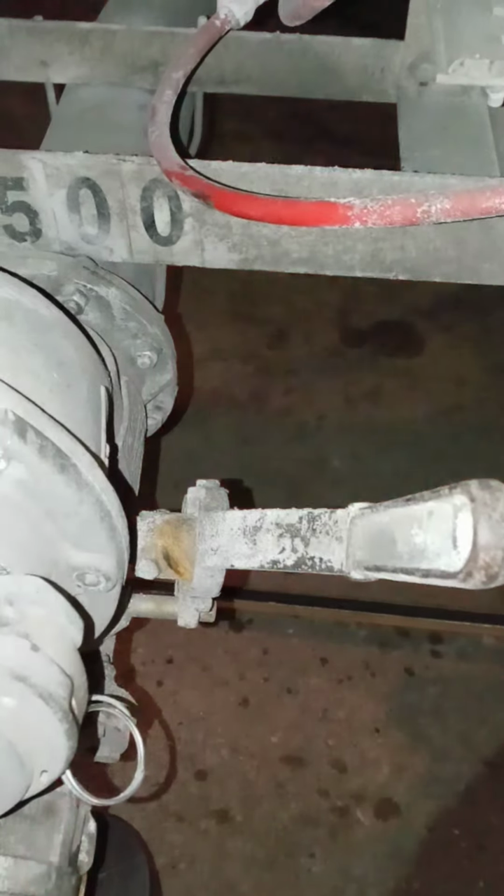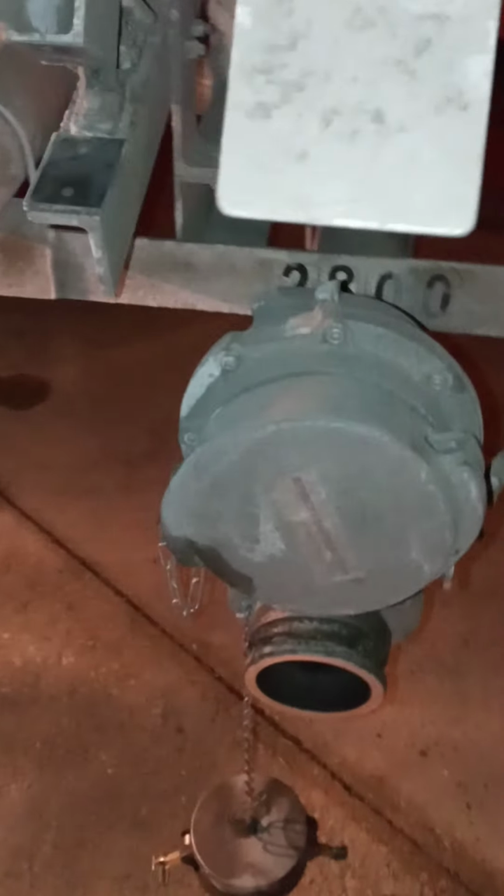So once that's connected and you have your safeties open, okay, then you pull this. That's the discharge valve. Okay, that opens up the valves to these pipes back here, which are connected to each of these different compartments. I've got 4 compartments: 3500, 2000, 1200, and 2800. Okay, that's how many gallons each can hold per compartment. So since I got 8700, I filled up my compartments as such. So from front to back, 3300 gallons, 1700 gallons, 1000 gallons, and 2700 gallons.